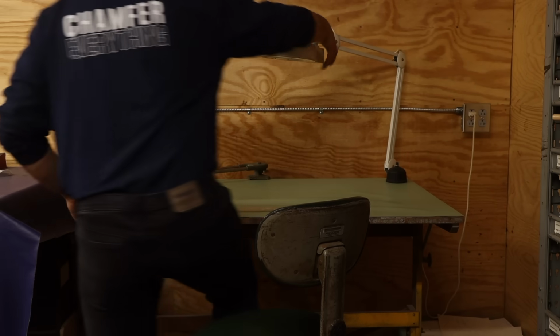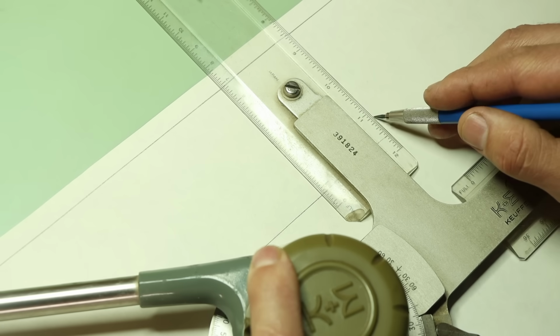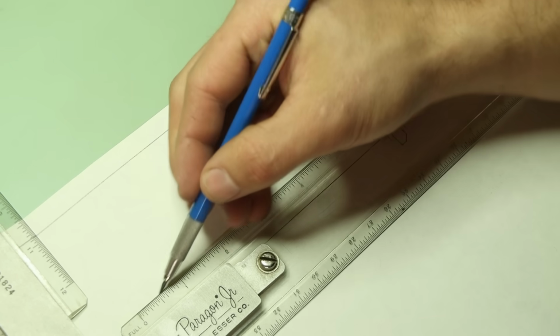This will need a bit more processing power than the old AutoPAD can handle, so I'll do a proper drawing on the drafting table. To start, I don't want this thing to be a permanent attachment on the lathe, and I'd prefer it to be easily removable. A rectangular cutout on the body will saddle the compound slide and clamp onto either side.